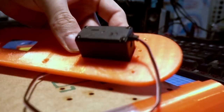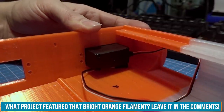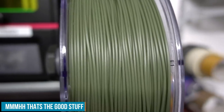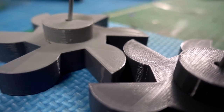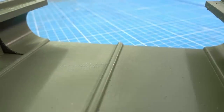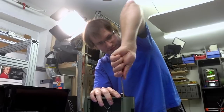I 3D printed my parts in very bright colors — leftovers from previous projects. I use bright colors because that tells me this is an early version. I print some of these, make sure they fit, and if they do the design moves on and I make changes. If I assemble the project mixing newer and older version parts, I know exactly which early versions need to be replaced before the project is finished — so it's easy to keep track. I tried to 3D print the wheels in flexible material, but the prints kept failing, and when I finally got one correct it didn't really work — it doesn't slip enough. The robot needs a little bit of slippage so it acts like a tank but with actual wheels. If they have too much grip, it just sticks and the servo stalls. So I want a little bit of slippage.